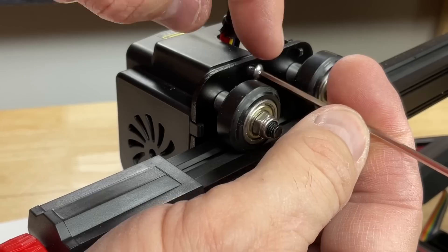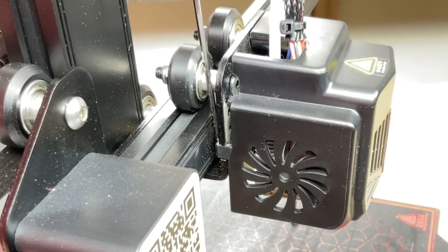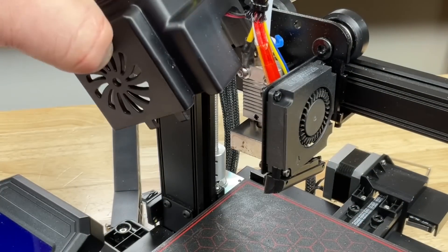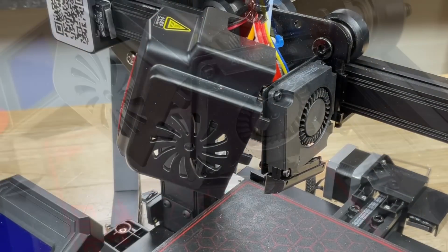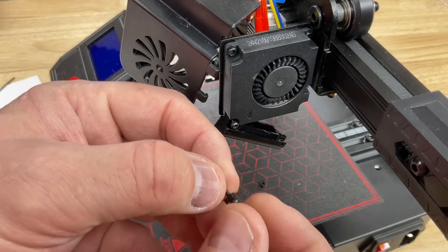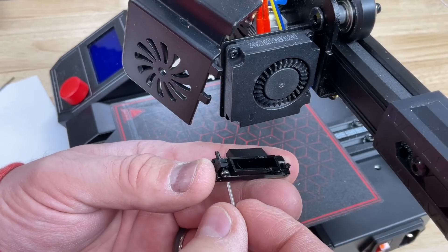The first thing is to remove the screw at the back of the hot end, then use the allen wrench to pop off the snap on one side and then the snaps on the other side, and this cover should lift right off. Here's the broken fan duct — it's broken on one side and the mount is broken too. Once I took the screw out I could see half of the mount still stuck to the screw. I removed the other screw and then took the whole assembly out.